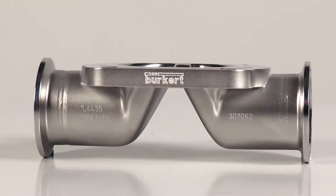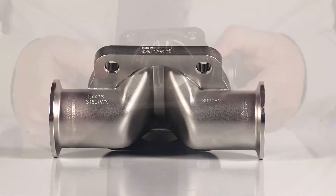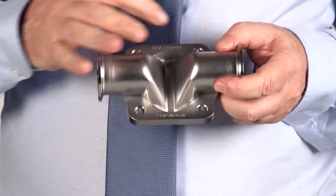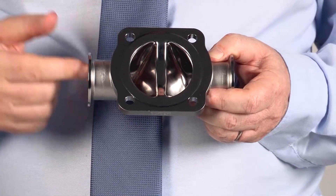The bulb is then cut and rolled so that the material is now flush with the supporting diaphragm. The tube is then laser welded to the flange, both on the bottom and the top. It is important to note that no material is added at this point. The weld on the bottom part eliminates any areas that can't be cleaned, and the only part of the valve that is in contact with the fluid is the tube material itself.